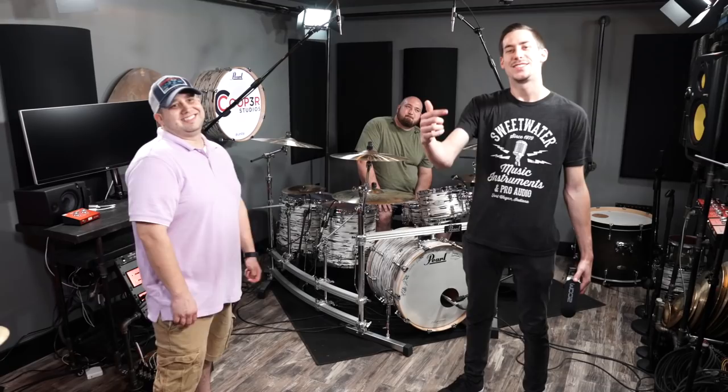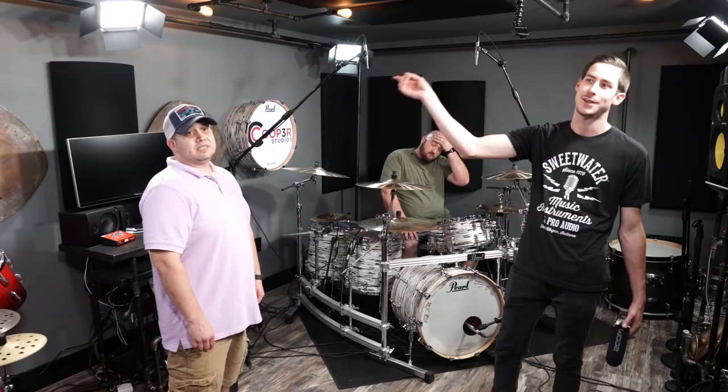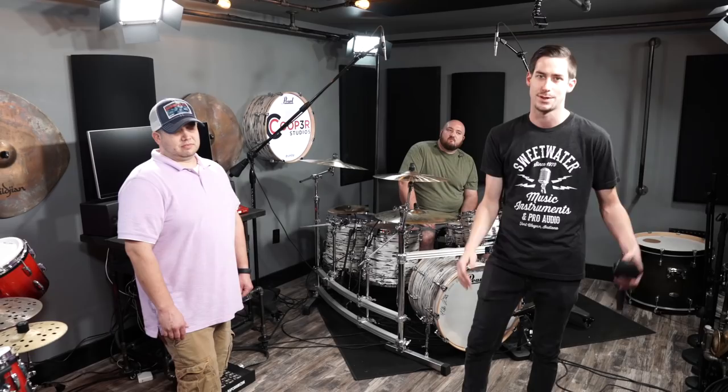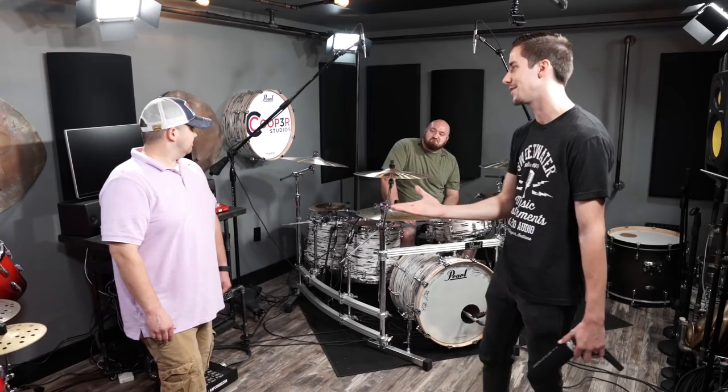Make sure you check out the video I did on how to soundproof your studio, drum room, or practice room. A huge shout-out to National Gypsum — their Sound Break XP drywall is a great product with a polymer layer between two layers of drywall that acoustically isolates them from each other. I also used Rock Wool Safe and Sound insulation between the walls. These products work whether on a small or large scale — even just adding another layer of drywall or replacing your current drywall and insulation will bring a big benefit to transmission between rooms. Thank you so much Aaron for coming out and bringing your gear, thank you Craig for tearing it up on the drums, and thank you guys for watching — I hope this was educational and entertaining!